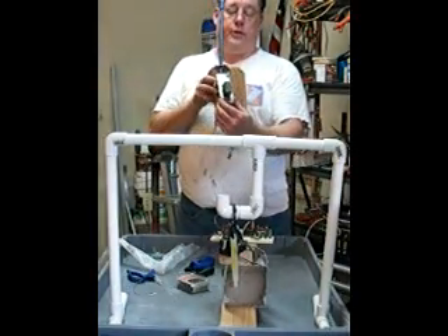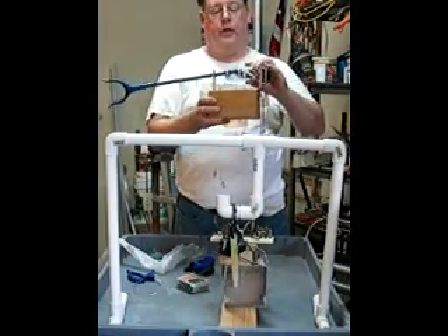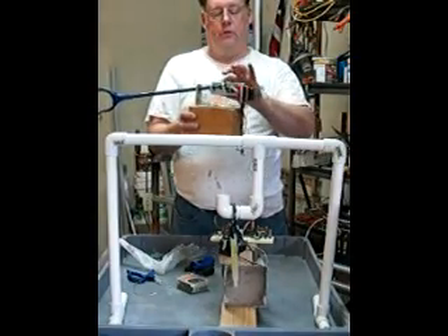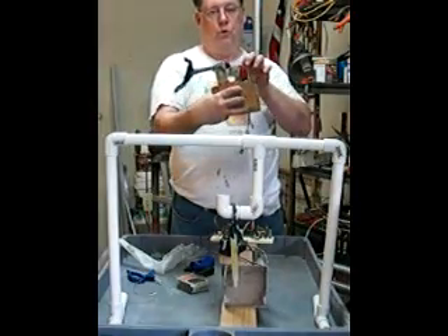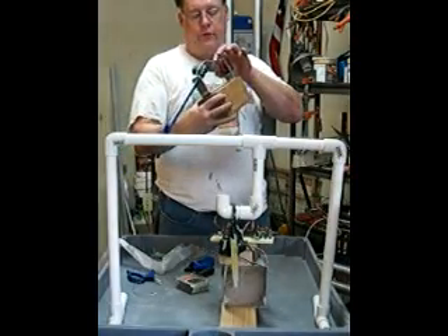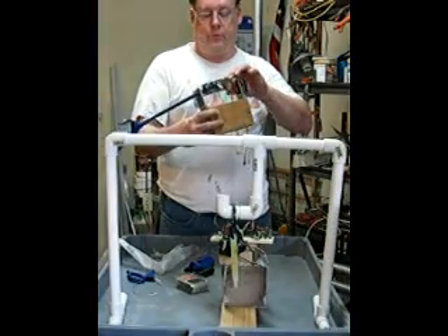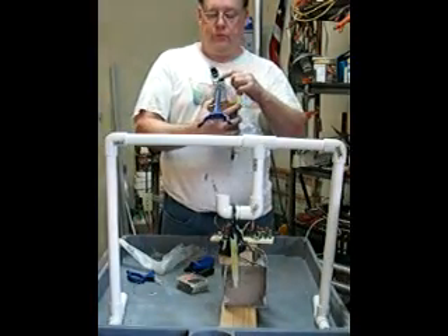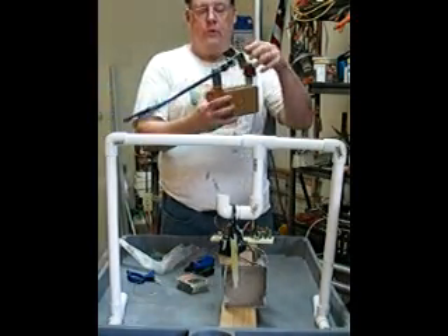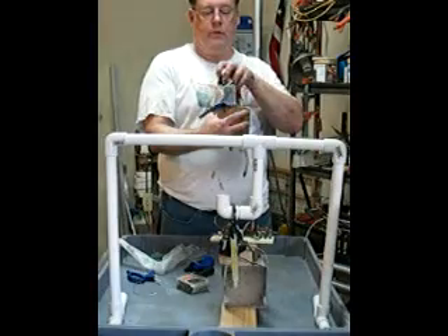Now once you have reassembled the shortened gripper, make an L bracket to hold one of the two servos. Mount the servo in the middle here, and then use these pipe clamps to clamp the handle of the gripper along the side there. Then you bolt the short end of the L-shape onto the second servo, such that it pivots the entire assembly. That also makes it offset, so that when this goes through the hole made in the C-shape bracket that holds the second servo, it swings up and down as it rotates.